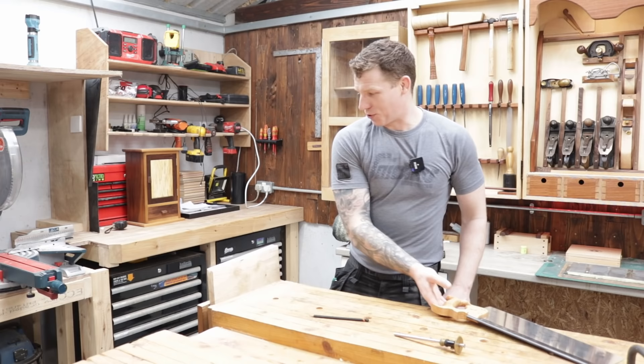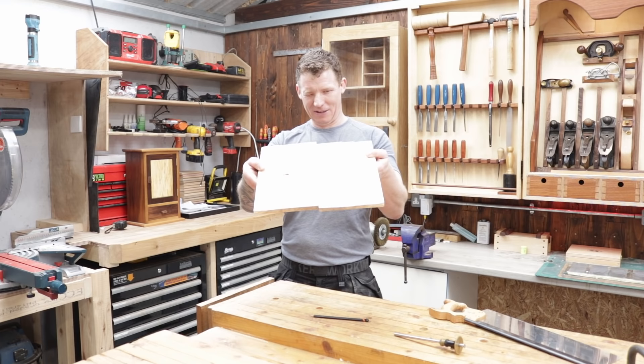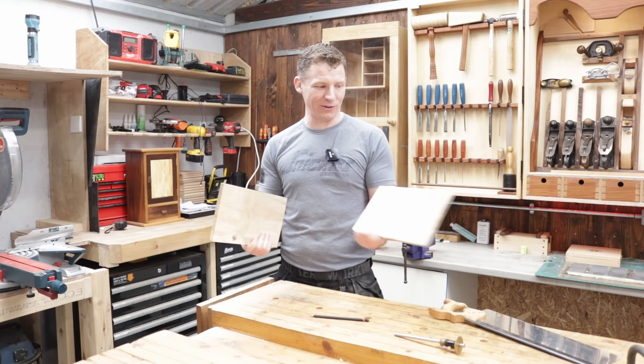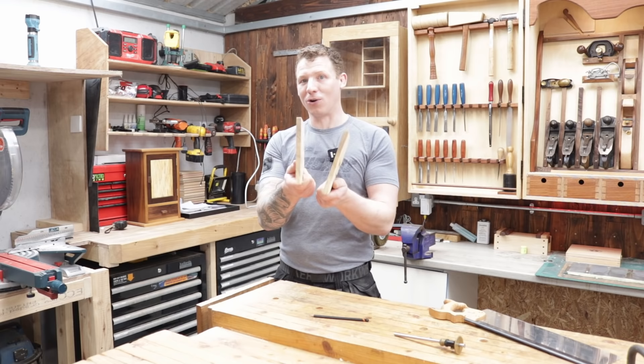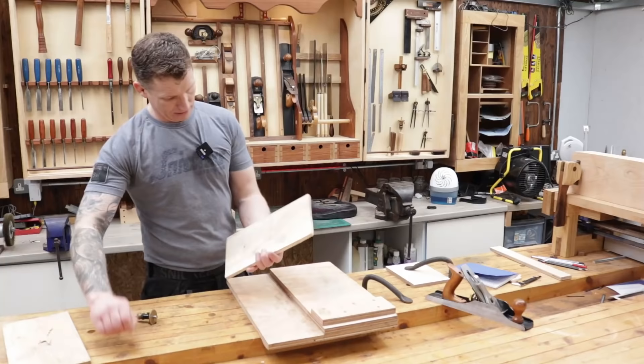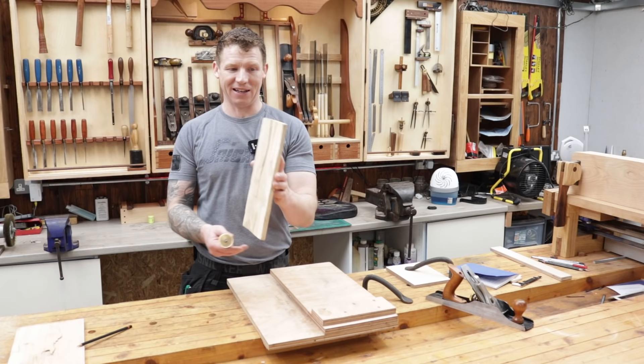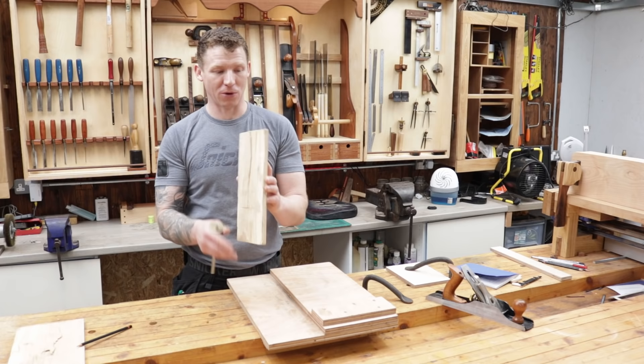We are now through, a little bit deeper than the saw is capable of going, but I really wanted to test it. Now we have a bit of planing work to do because I had to come at it from multiple sides. Re-sawing boards with a large tenon saw is definitely something to practice — you really want a large hand saw for this. But if you come corner to corner and line up your cuts you won't go too far wrong. Now we have two boards to plane and thickness.